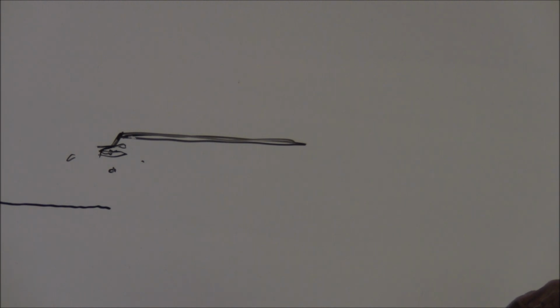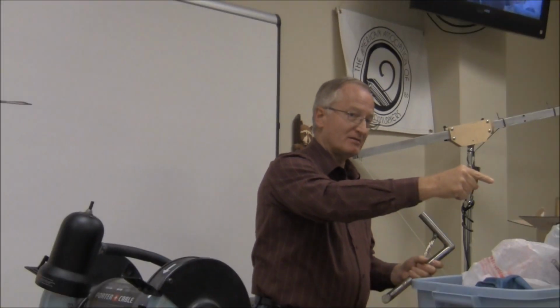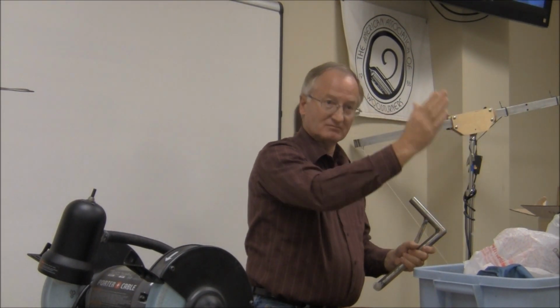Won't the beam be distorted on the side until you get it to the point it's the right thickness? Then it'll be straight? No, it's a straight light going up and down. As long as you can see the light on top of your work, you know you've got more to cut. Once it gets right to the edge, then you know you got to stop. If you assume the light is a cylindrical beam, dead center on top of the work, it'll be a dot. Off to the edge, it'll be an ellipse. Yeah, you're right. But as long as you see the dot or the ellipse, you know you still got to go. Once that ellipse starts to go off the side, maybe when it's halfway off, then stop.